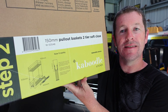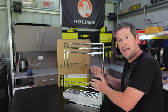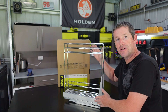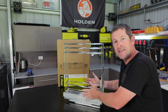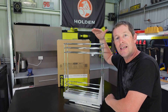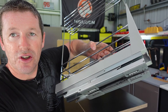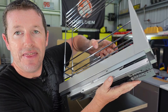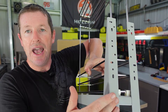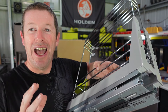What we're installing today is this Kaboodle 150mm pull-out basket system. This is a base mount basket system that's approximately 100mm wide, 560mm tall and 450mm deep. If you're looking to buy one of these, it's very important to make sure you get the right size and mounting option. Most people go the base mount as that lifts the unit up and provides clearance for it to come out over the bottom lip of the cupboard. If you do a side mount unit, which some of them have runners on the side, a lot of them are too tall to fit in the standard cabinetry and openings of the caravan joinery. You have these soft close runners that base mount onto the floor of your caravan or camper trailer, and then a steel frame chassis that the basket clips onto, with plates on the front that allow your joinery panel to be fixed onto it to match in with the rest of your joinery inside your camper trailer or caravan.